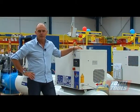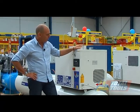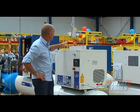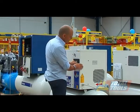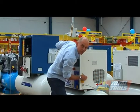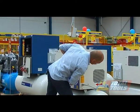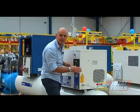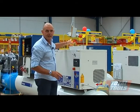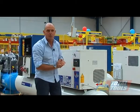One very important feature of these FIAC rotary screw machines is when they're first turned on: it's very important that the belts are running in the right direction. There's a big red arrow showing the direction the motor should rotate. When you wire it up, turn it on and off quickly and check that it's rotating in the right direction. If it's running in the wrong direction, you have to rewire the plug to swap the two active terminals, and then check again that it's running correctly.